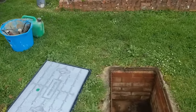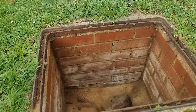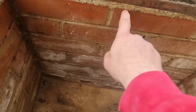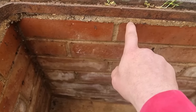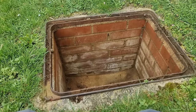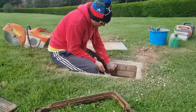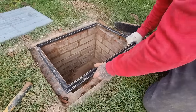Now it's time to replace one of the ones that's been chipped and is slightly high. This one isn't that high compared to the grass, so I just need to get it down about 15mm. I'll take this bed off, set it on dry, and put all the muck around the outside to keep it locked in nice. I fired up my disc cutter, cut right around the outside, then used a hammer and bolster to chip off the excess concrete, and brushed it all back clean so I could bed on the new one.